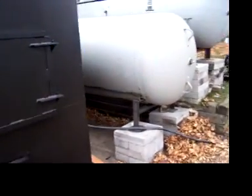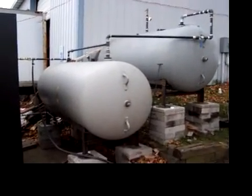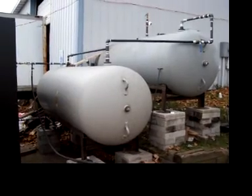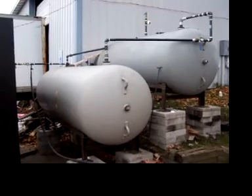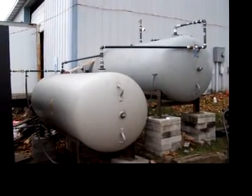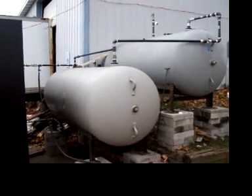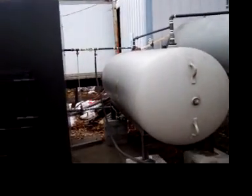All the panels have been installed. We have installed two 1,000 gallon tanks here, which are going to be used for additional capacity and also recycling the steam. So we will be capturing the steam in a condensing tank there. The taller tank is going to be the condensate tank, and the lower tank is the boiler reserve water, which is currently bypassed.